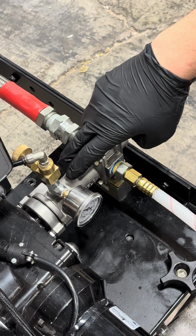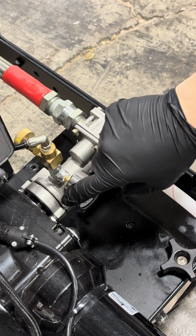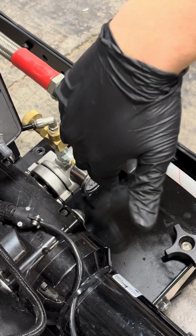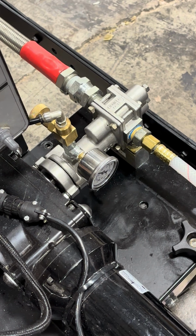And one of the things that we recommend on this pump on a weekly basis is to flush and make sure we have clean grease in here, and the grease also needs to be pressurized. Part of that grease pressure helps maintain and push the adhesive back and keep it inside the pump so it doesn't work its way into the gear motor over here.